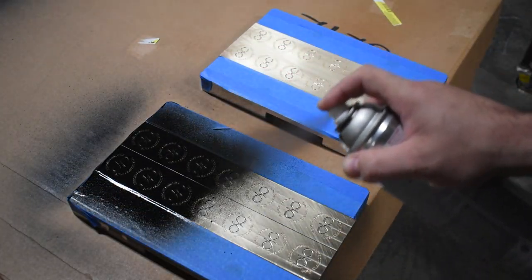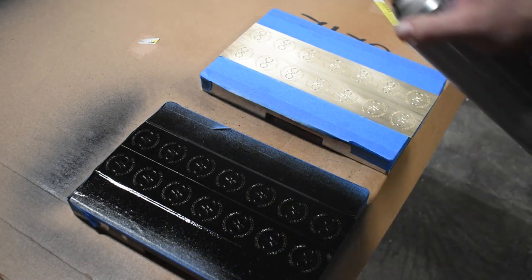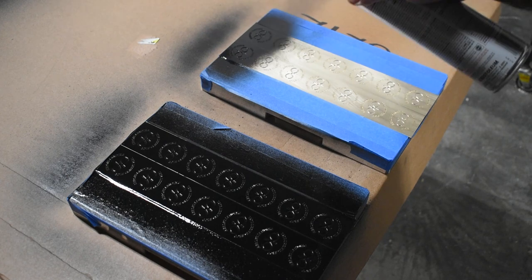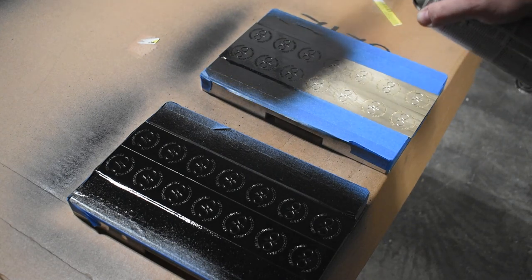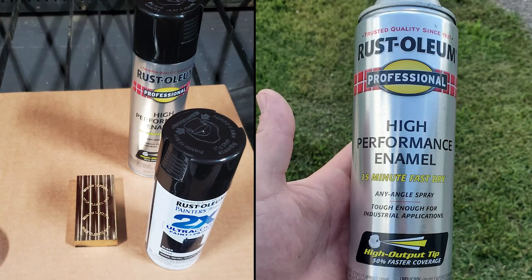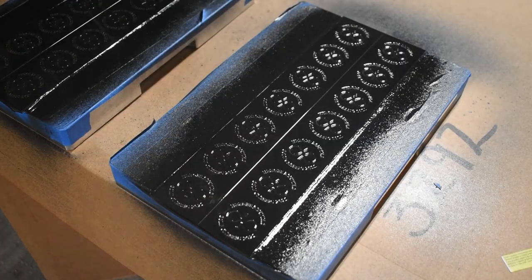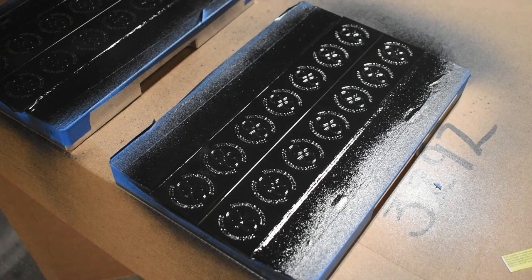For the paint testing I really just didn't want to sit down at a table and individually fill letters with black before I would face the coin. I tried lacquer, I tried epoxy, and I tried enamel — a few different brands of each of those. After the first spray paint, the specific paint I used was a Rust-Oleum high performance enamel. I really liked the finish that came out of it. It didn't bubble and it claimed to have a fast dry time, which wasn't really the case. I may have been spraying a little bit thick but I came up with a way to get around that.